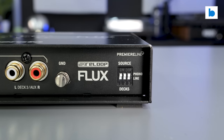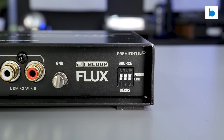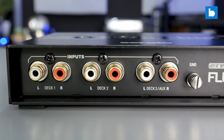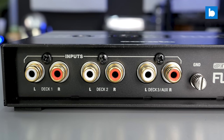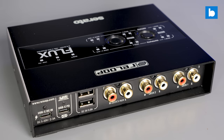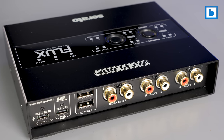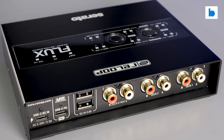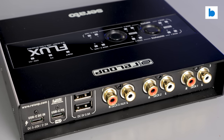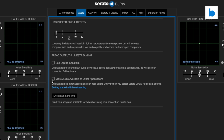I haven't even really mentioned the fact that the Flux is a three-channel device yet. It has three stereo inputs, all switchable between line and phono level with dip switches, and three matching outputs, all at line level. This allows DVS control of three decks at once, but it also opens up other possibilities. For example, if you're using a three or four-channel mixer, you can route the output of the sample player to a third channel. You can also run a spare output from your mixer back in for recording, as you used to be able to do with the SL3. But where Reloop have been especially clever is working with Serato to ensure that the third input is routed via the software to new options — so you can enable 'use laptop speakers' and send audio to other applications using that input, meaning you can use the Flux as the basis of a streaming setup, just as you would with a supported mixer.